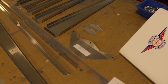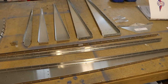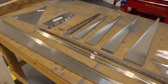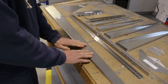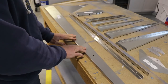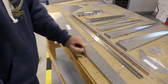These are all of the parts that come with the rudder kit. It's hard to believe just those few parts — well, and those skins leaning against the wall — but it's kind of amazing that just these few parts will build a complete rudder for an airplane. Before you get started, one of the things you might want to do is run your fingers over these holes, because most of them do not need to be deburred according to Zenith, but every once in a while you'll come across one where you can feel a little burr.